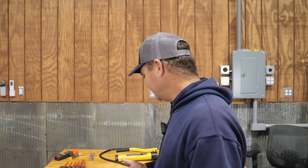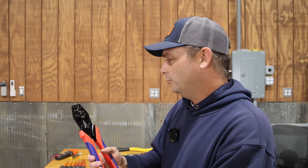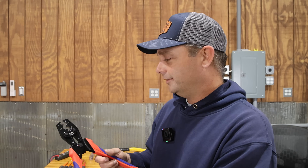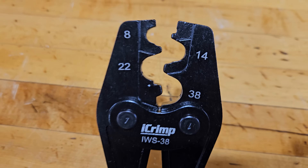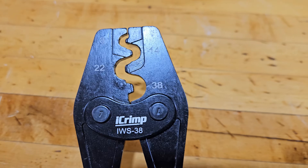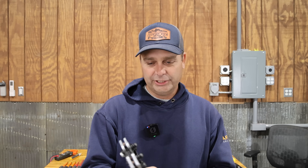When you're working with wire that's two, four, or six gauge, these other tools aren't big enough to crimp a terminal on. You need a bigger crimp tool. This iCrimp tool is in metric, but personally I know it covers eight, six, four, and two gauge. This is an indent-style crimper — it puts an indent into the middle of the crimp, pressing it onto the wire. I think indentation crimpers actually hold better. When you get bigger than two gauge, you'll need an even larger crimp tool.